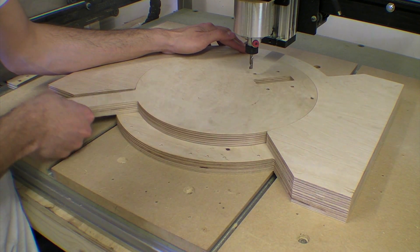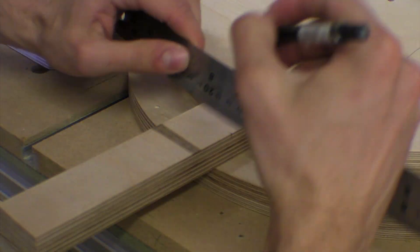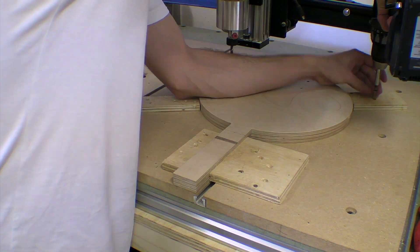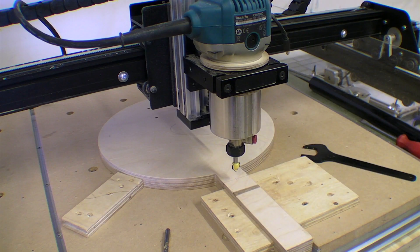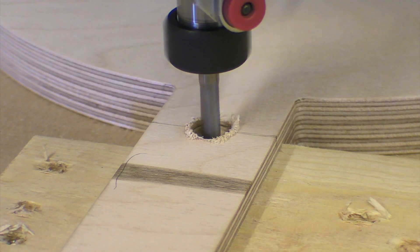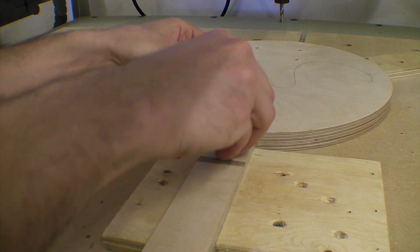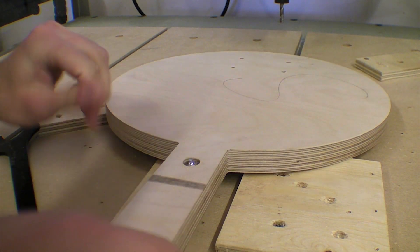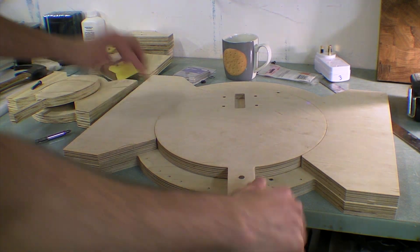I now want to add the positive stop. The first thing I need to do is mark the centre where the ball catch will go. In the software I made the larger recess for the head half a mil deeper and the narrower hole for the body marginally wider. I then attached the turning component to the CNC wasteboard, using a V-bit to centre the spindle over my mark before turning the power on to lock the motor. I then raised the spindle and changed over to an up-spiral single-flute bit to make the cut. I sanded the breakout from the surface, pushed the catch into the hole using the spindle spanner, and the bottom of the catch sits flush with the surface for a good finish. The clicks are very satisfying.